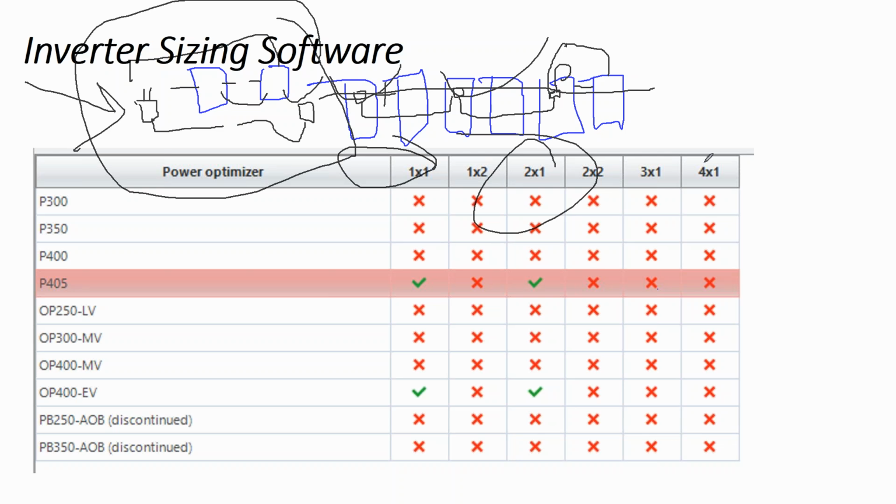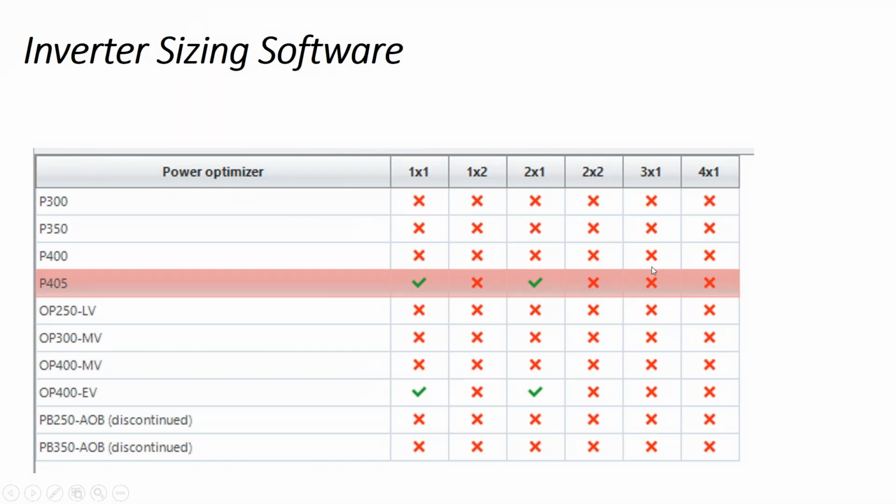because of the wiring and cable management of just getting all this cable up on the rooftop in a workmanlike way can be quite difficult. In fact, I've only recently kind of mastered my DC optimizer cable management. And what I do now is I assemble the whole rail and cabling system except the modules down on the ground and then hoist the rails up to the rooftop kind of pre-assembled, simply because otherwise it's just very complicated when you're up on a roof and it's hot and it's slanted to make sure that everything is up to 100%.